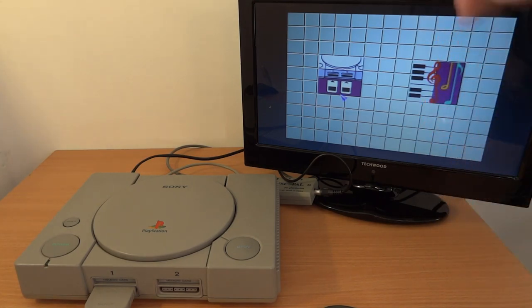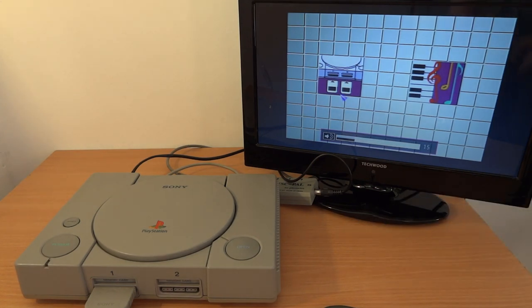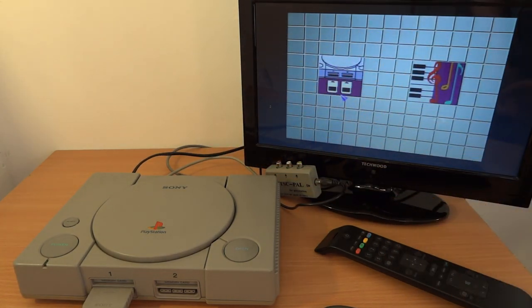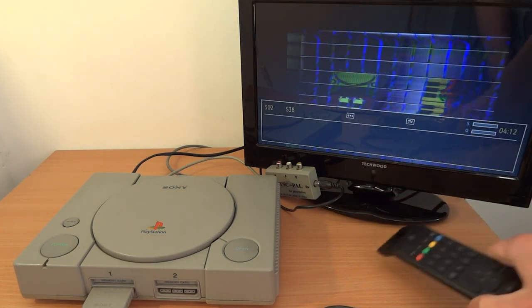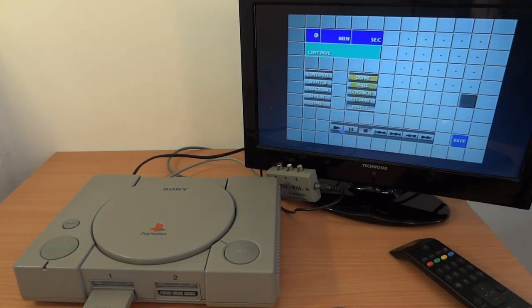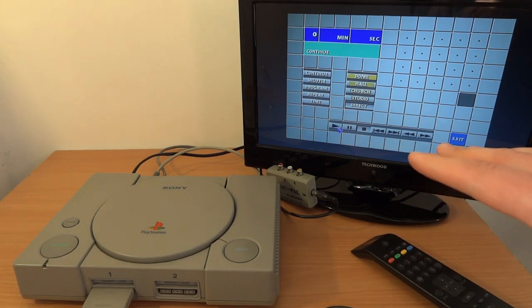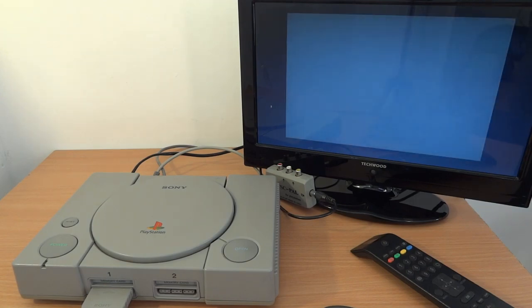It found two channels. If you listen carefully, you'll hear this amazing sound — that's the RF out. It will probably work a lot better if it were powered like the original accessory, but this one isn't. As you can see, one channel is completely off — you cannot see anything, while the other works but the colors are all off. Let me do a quick switch to RGB mode — there we go, perfectly fine. Let's try a game for a better comparison.